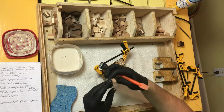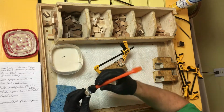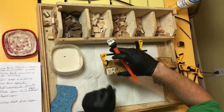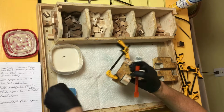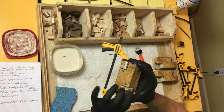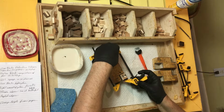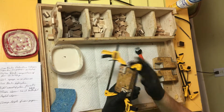And sort of check this. I'm gonna go with the curvy side so it looks good. There's a little decision making as you do this. So I push that, some of the glue squeezes out, that's fine. Wipe that off so it's clean for my clamp. Push everybody in. Push the gaps out. Get my clamp on there. Give it a light clamp. More glue pushes out, reclamp it.